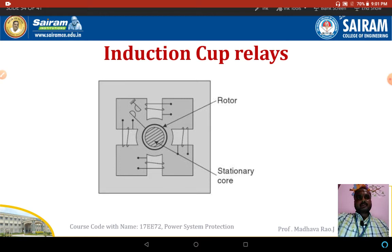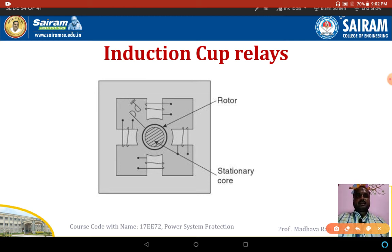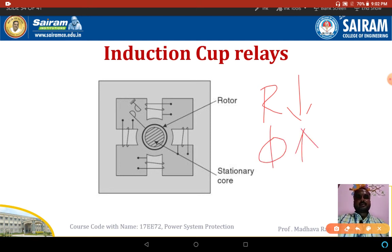The inertia of the cup is much less than the disc. The magnetic system is more efficient and hence the magnetic leakage of the magnetic circuit is minimum in this type of relay. This magnetic system also reduces the resistance and increases the induced current path. The weight of these relays is low compared to induction disc relays, and the efficiency of the magnetics is more.